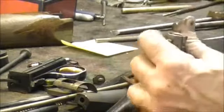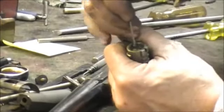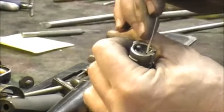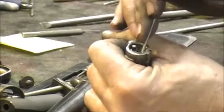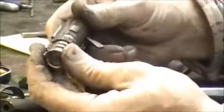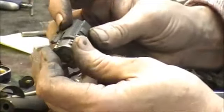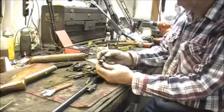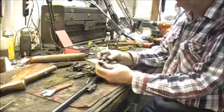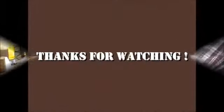You always want to check your bolt — make sure the internal ejector in your bolt face is free. Push it in and out, check your extractor, make sure the spring on it is good and that it comes back into place. That's really about the only problems these have. I have seen on some of the newer Portuguese-assembled guns, little chips break off the actual bolt body. The old Belgian guns seem to hold up better and don't do that. But the biggest problem these Belgian early guns have is this one.